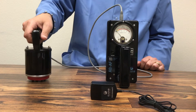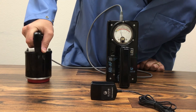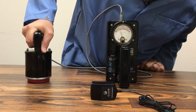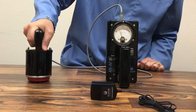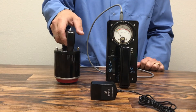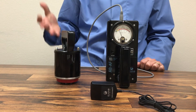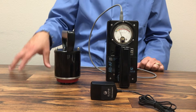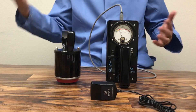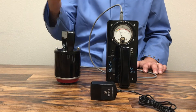Since this table is dry enough, you'll notice the needle in the dial is moving almost to the center, which is in the unacceptable or poor range. A completely dry, passable radome would read in the good range — all the way to the left. Since this table is not a radome but just a dry piece of wood, it is measuring unacceptable or poor.